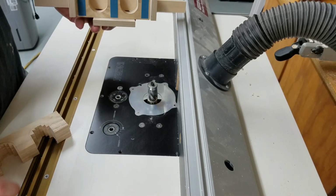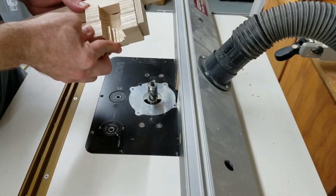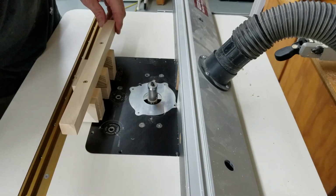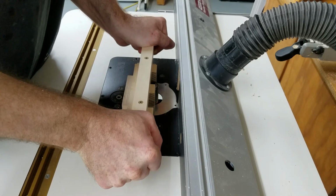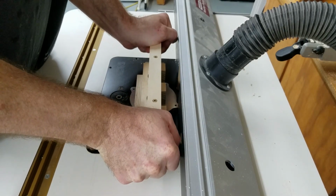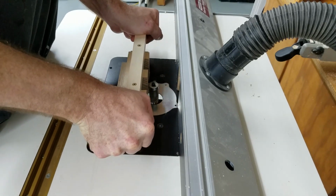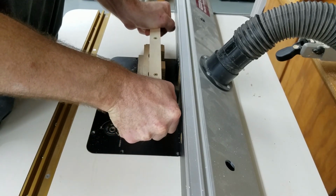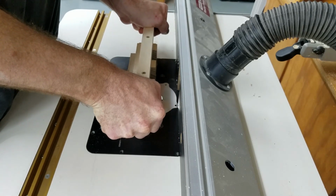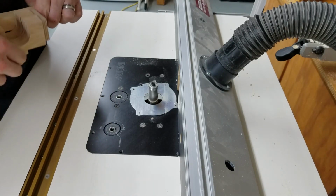Once I got the original prototype just right, I was able to use it to build this jig that had a couple pieces of sandpaper in the bottom and some blocks around the edges that held the rough cut bandsaw pieces in place, so I could use my router table and a flush trim bit to cut everything to an exact match of the original. The only downside is that it involved using a $175 Whiteside ultimate flush trim router bit. Very smooth cutting, very easy to use bit.